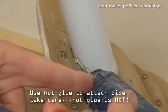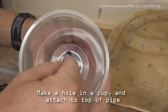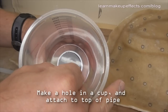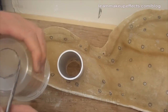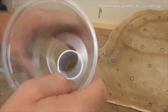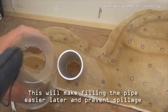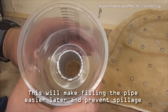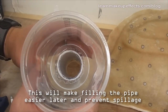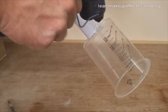I'm going to use a hot glue gun to temporarily attach the tubing to the hole. Using a plastic cup, I draw the circle shape of the tubing and cut that out, then hot glue it onto the top of the pipe. This gives me a big receptacle at the top to contain the silicone, so I'm not just pouring down a tiny tube — it makes it much easier to pour without spilling everywhere.